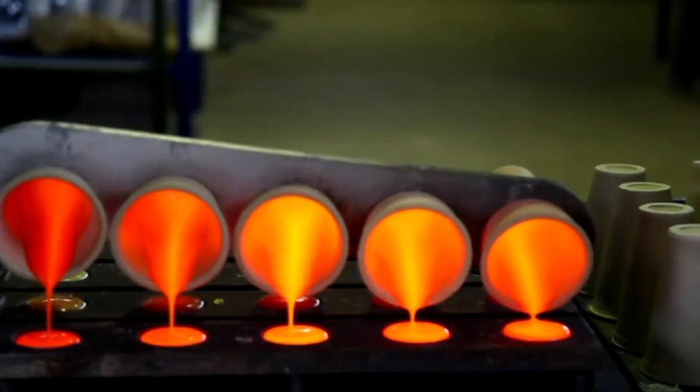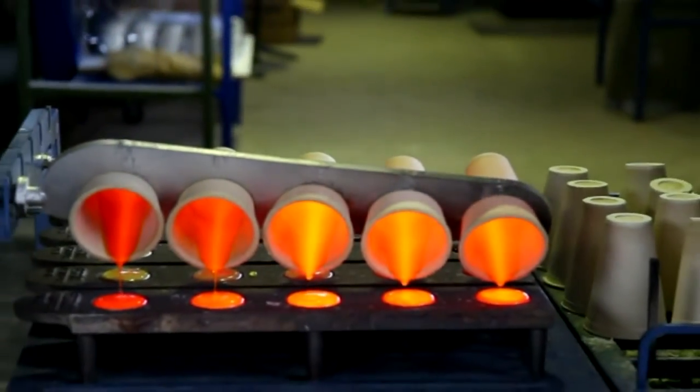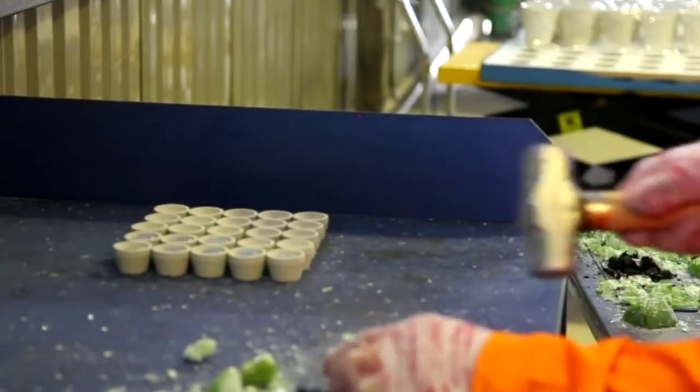The next stage is the pouring stage, which takes that pot out and pours it into the steel mould. The molten lead will sink to the bottom of the mould and the slag will form a second phase on top.